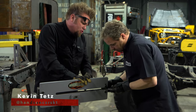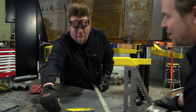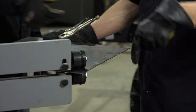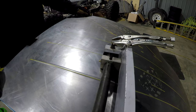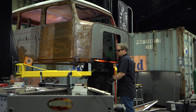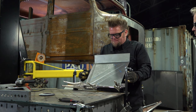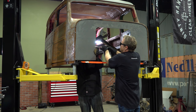Over at my buddy's shop, we work out the bead roller setup — marking the center line and planning a longer cross line for the actual panel run. He guides and turns at the same time to make complex shapes. We cut and bend the footboard piece up slightly so I've got two flat mating surfaces for the rosette welds. I feel it until that angle is 90 degrees — and just like that, I've got a footboard. This is the start of the Willy's Wagon's floor.